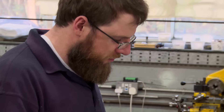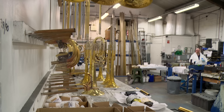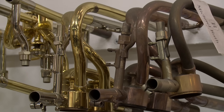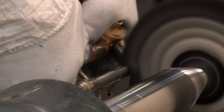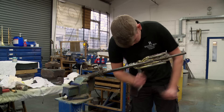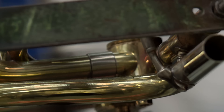It's ready to pre-polish. After multiple stages of cutting, heating and cooling, the brass is tarnished. And since the trombone is the pride of a brass band, they need to make sure it sparkles. To buff it up to an even shine, the parts get a brush from polishing machines. Any hard-to-reach corners are sorted with a strip of rag and good old-fashioned elbow grease.